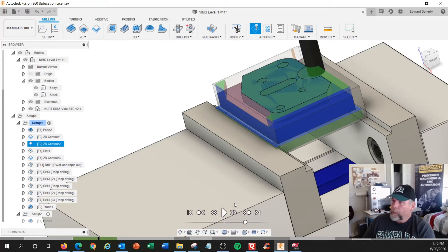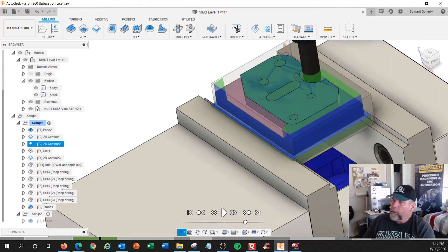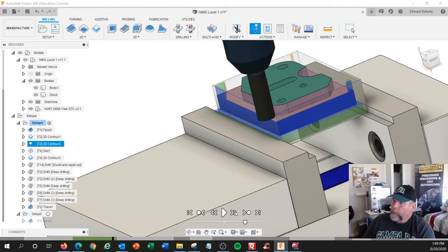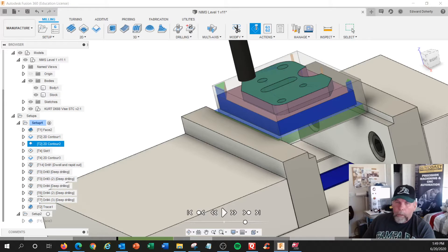This one is going to take a big cut here — this is like half the... right there, that's a slot. Slotting is like the toughest thing for an end mill to do, and this is like fully engaged there — 180 degrees of engagement. Go around, go around, go around, go around, go around. Done. We ended up with these islands on there.